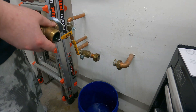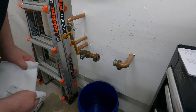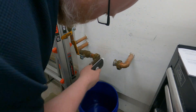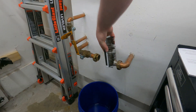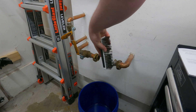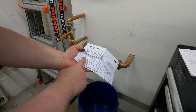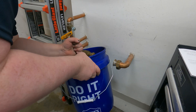There it is — not that big of a deal. This one actually had a little screen, which is neat. At this point we want to really clean off this surface because we want the gasket to make a good seal. I'm just going to take a wire brush — you don't need to go too crazy, just make sure everything is cleaned off. Step one: be a qualified licensed plumber. Step two: flush the supply line to remove anything that could be in there — we'll do that by turning it on real quick.